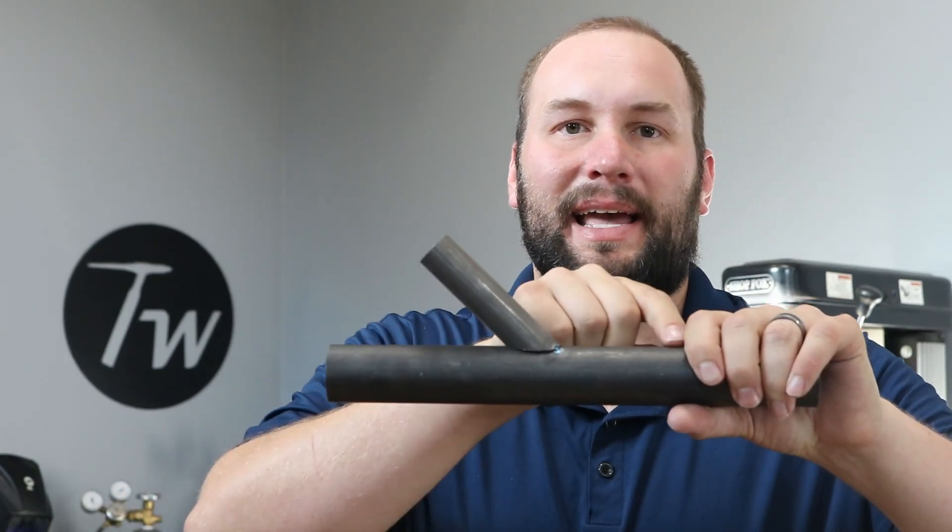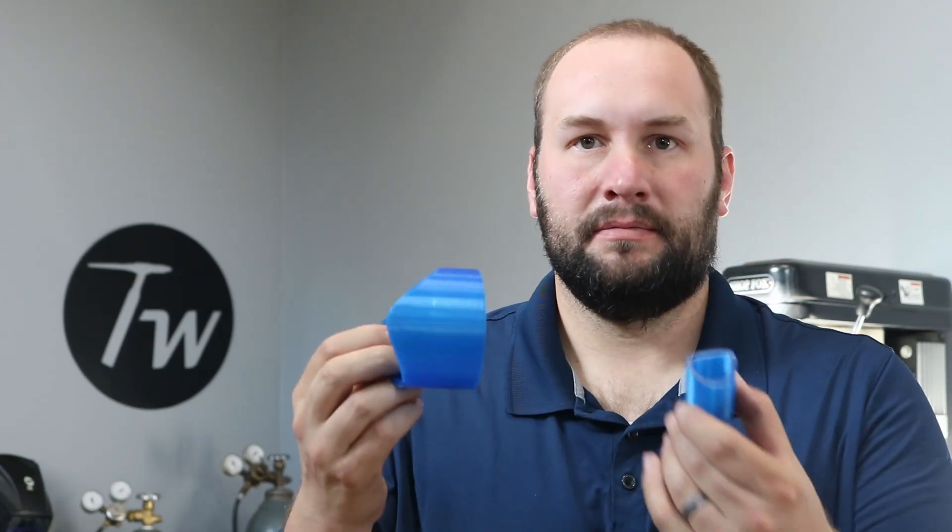That can be defined mathematically. So I wrote some code — it's linked down in the description below — where you just put in a few parameters such as the diameter of the tube that you're notching, the diameter of the tube that it's mating to, and the angle. It'll give you a template that you can use to trace the exact profile you want and cut it out. I'm going to show you how to create that model and how to cut them out and how it works.